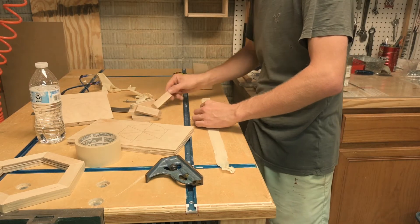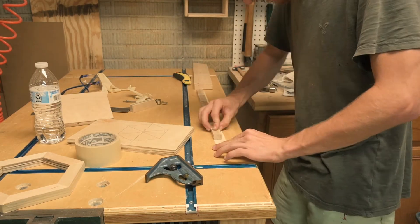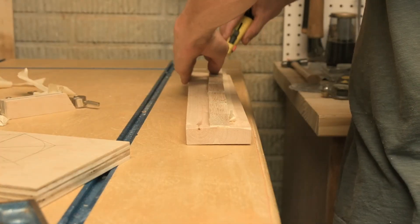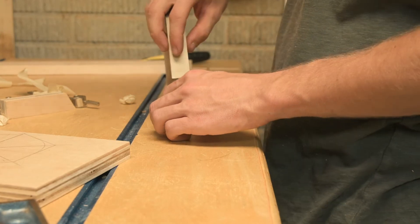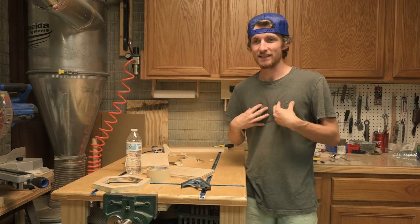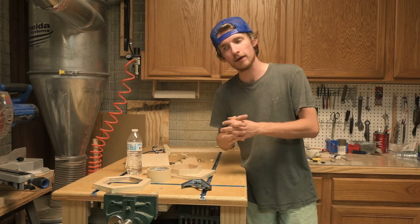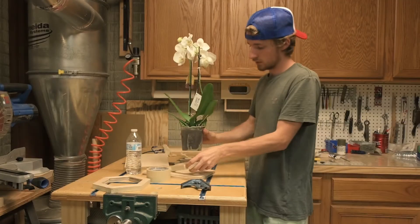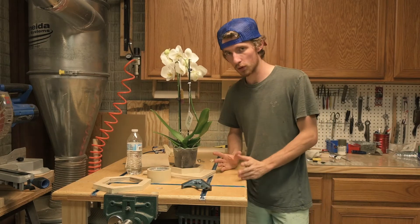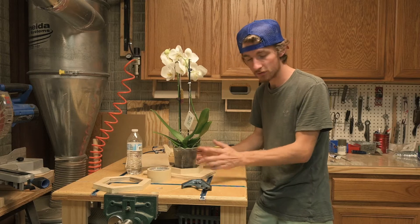I've got all the pieces and I'm going to lay out a piece of tape and set all the pieces on it. There's our hexagon. In the beginning of this video you'll have seen the finished product — as of right now I can't visualize that because I haven't made it yet. This hexagon is basically going to be the rim where the pot sits, then we'll have another hexagon at the base as a solid piece of wood, and I'll put a little chamfer along the edge after gluing it up.